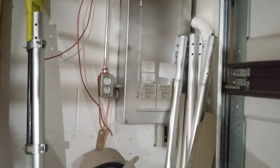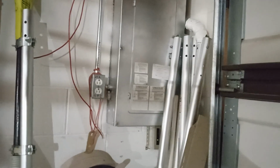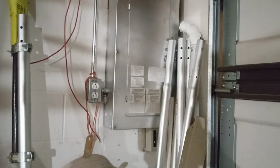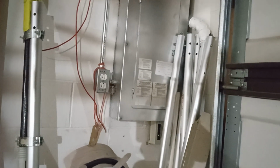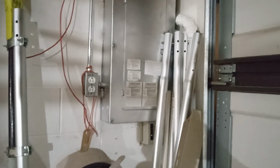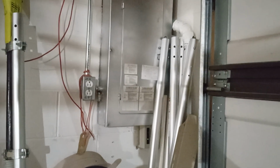In my installation, that would be 150 foot of wire, and have a low enough impedance to couple a lightning strike. It would have to be as big around as my arm. It's forbidden by code to do that. The purpose of multiple rods is not for the loads. We're forbidden under code to put ground rods to ground at the load.